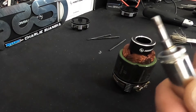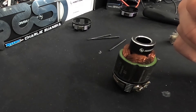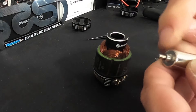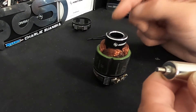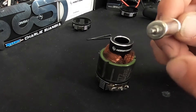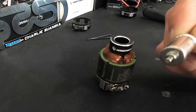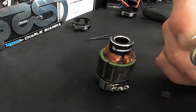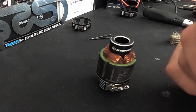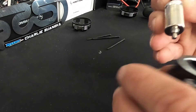Rotor tube goes in. If you need to get your shim out and put it back, make sure you keep track of where your shims are. One of the problems you'll run into rebuilding motors is the distance of the rotor from the sensor board in the end bell — that can affect your end bell timing. As the rotor gets farther away from the sensor board, it changes how the timing is read by the speed control. It even changes with RPM, so keeping that consistent is pretty important.